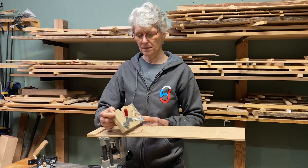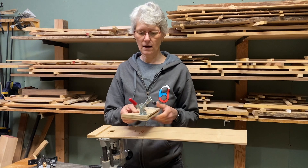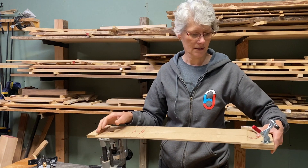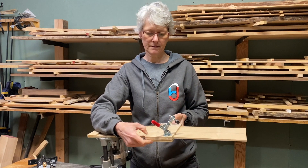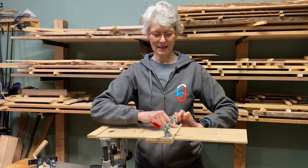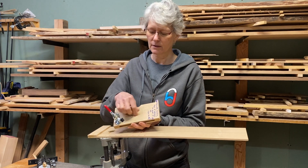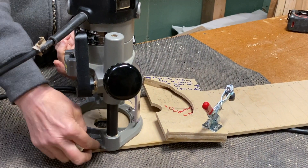This plate needs to be at least eight inches wide — wider than the base that it slides on and off of. It just has two quarter inch thick MDF pieces on either side. To ensure a good snug fit, put it on your board then glue the quarter inch MDF in place, making sure you're not gluing it to your platform, and glue the second piece on top. For the cutout, I simply set the router in place and traced around it so I'd have a cutout for the base, allowing the router to come in nice and close.